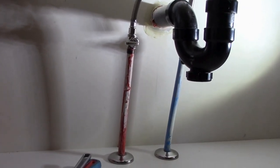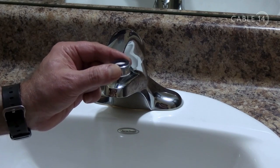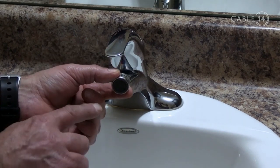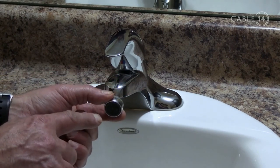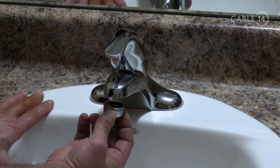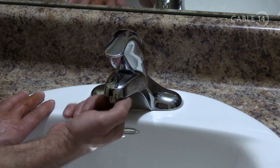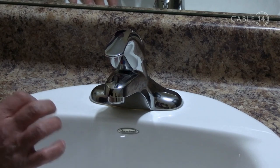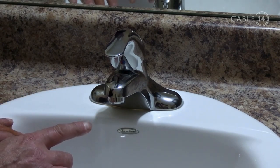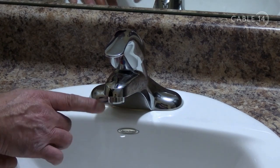Then we're going to show you how to attach the aerator — the final step before turning on the water and testing the faucet. If you're cutting into copper or soldering or doing any involved plumbing, always take off the aerator first. The aerator has a fine screen in it, and you don't want to trap any debris in it — they're easy to replace. Put it in the bottom, wiggle it, line up the threads, and tighten. Stop at hand tight. If you have an issue, you can use adjustable water pump pliers, but wrap the pliers with electrical tape or cloth so as not to mar the nice chrome finish.